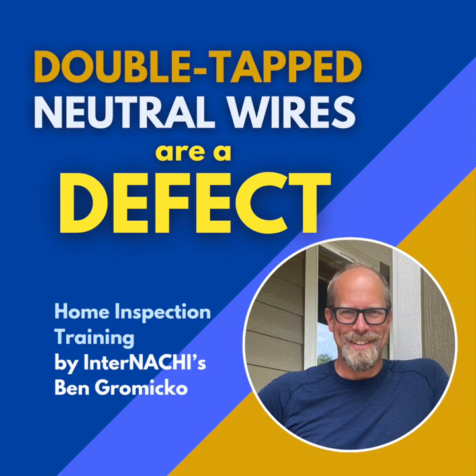It really just reinforced a foundational rule that's been in the NEC forever: Section 110.3b, which basically states that all electrical equipment must be installed according to its listing and the manufacturer's instructions. Since the vast majority of those neutral terminal bars weren't listed or identified by the manufacturer as being okay for more than one wire, double lugging was always technically violating that rule, even if people didn't realize it or chose to ignore it.